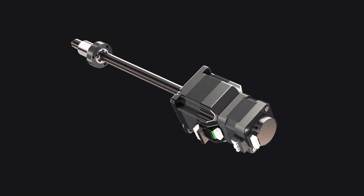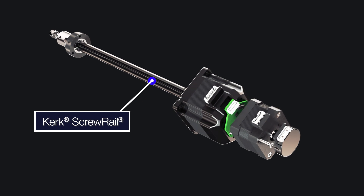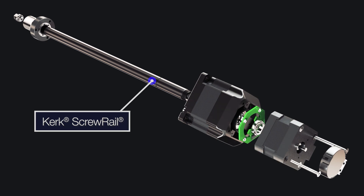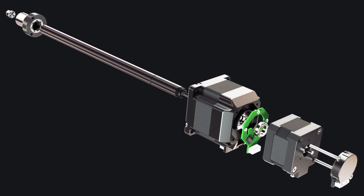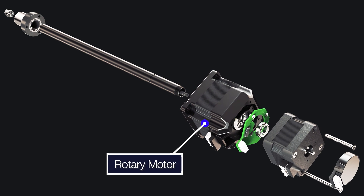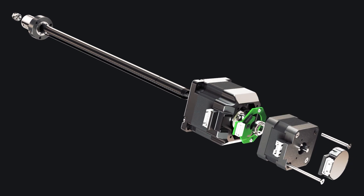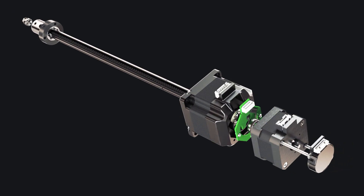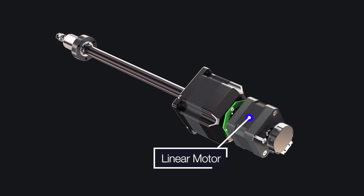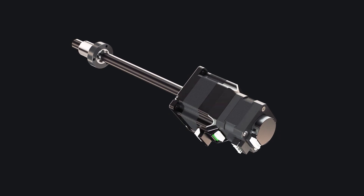The linear action is driven by our screw rail assembly. Here we have a steel rail driving up the center of the carriage, encasing a lead screw which propels the carriage forward. The rail in this case is integrated into the first motor, which will independently control the rotational motion of the Z Theta device. The linear motion is controlled by the screw, which passes through the first motor into the second motor. These two motions are now controlled independently.